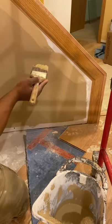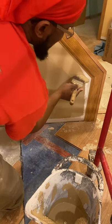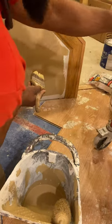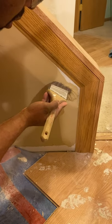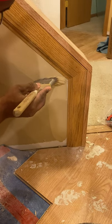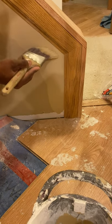Another thing you should have when painting is a light — a halogen light will really improve your painting skills. Now this is going to be the fun part when it comes to corners. Everybody wants to know how do you get up in a corner. It's that pushing method I told you. Get in there and really see this — this is real important. You get right there and you'll be stuck. You don't need much paint — you actually want to do it kind of dry. Push it in there, get to them corners, just push that up in there. You don't even drag it. Whenever I come look at a job, the first thing I go to is the corners. I want to see the detail work — that will show me the true skill of a painter.